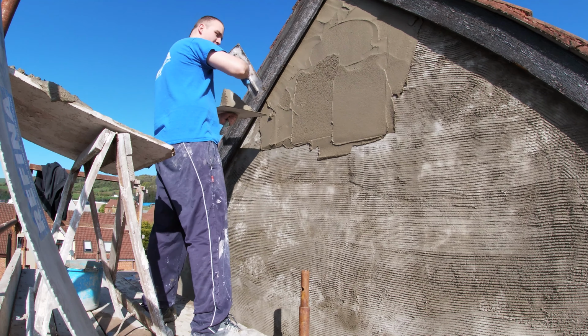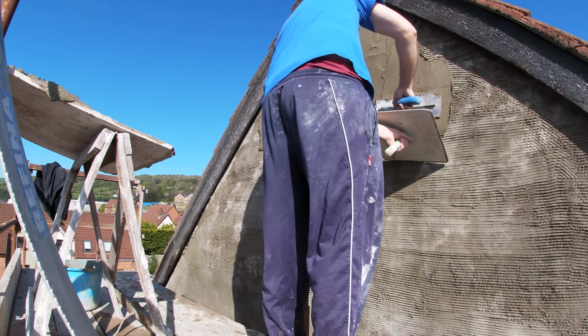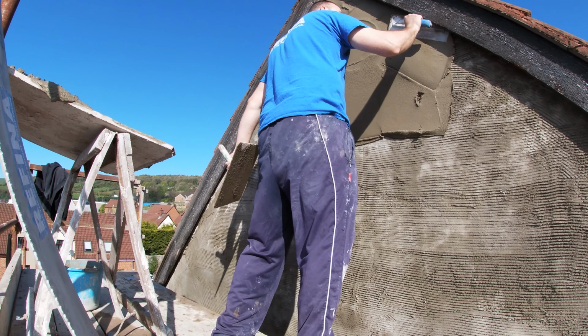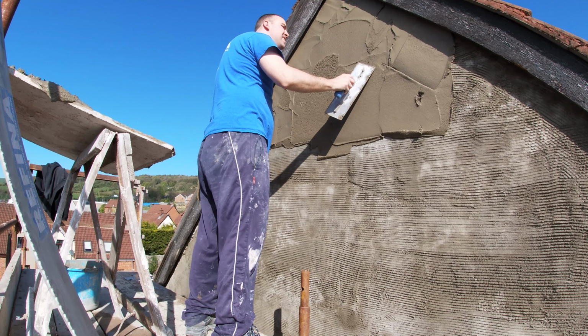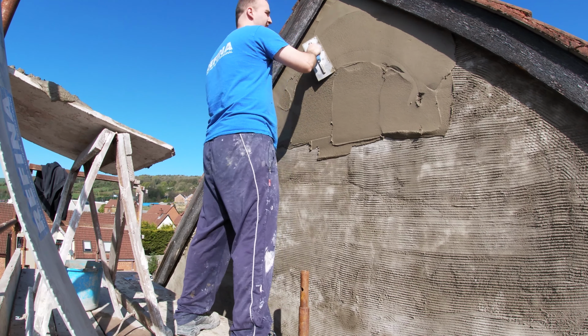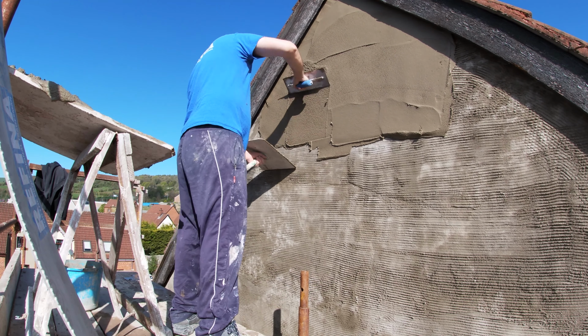But so, back to stage one. Get the wall coated, get it scraped down, wet down if needs be. If you scratch it the day before, depending on size, you might not need to wet it down too much. And obviously your mix, plenty of mixing videos on the channel. They're really covered in detail there.